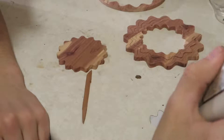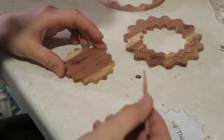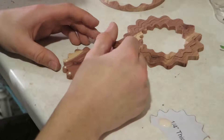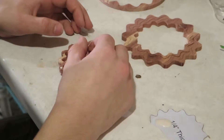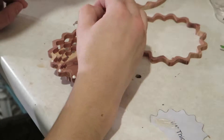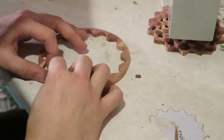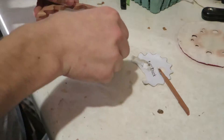Now we can squeeze out some glue. I use a scrap piece of cedar as a little toothpick to put a drop on it — just go all the way around and do that on all the rings. You have to alternate your rings from left to right when you're going up, because they won't stack up right if you don't. You could just put them randomly, but I like to match up the grain. Once you cut it out you'll know what you have to do — it's really easy. I like to use a battery as a weight, or you could just use some sort of heavy piece. The ring that I broke is glued up, so I can glue that on now — if you didn't break it you could just do this all in one step.